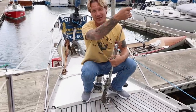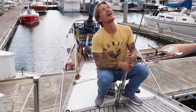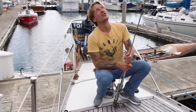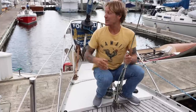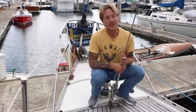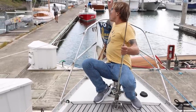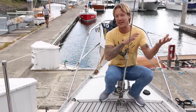So what you can do now is put a hank on sail on this thing, and what it does is it takes the sail area of the boat and brings it inboard. With this little sail, you could probably handle 30 to 50 knots. With this big sail, you could probably handle 6 to 30 knots. So I really, really like this setup. The reason you do this is because it's hard to get this sail around this stay when you're tacking in light wind.